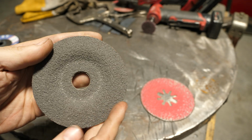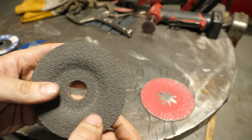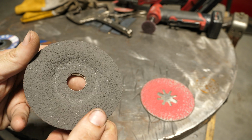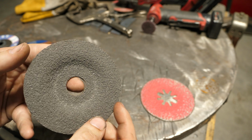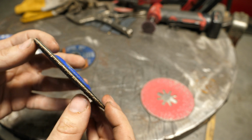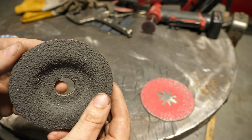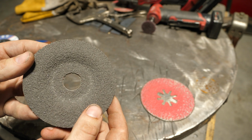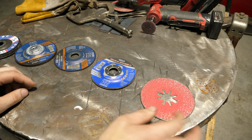Very thin. I'm going to attempt to use this today for mill scale removal. I have a feeling this is like 20 grit. It probably will work fast. It'll leave a terrible surface finish, and it probably won't load up on mill scale. But I gotta be honest, I don't think that this is gonna last all that long. I mean, the coating, if you can even see that, is literally like non-existent in thickness. So I don't have high hopes for this, but I've never used one and I happen to see them at the local store, so we'll try that.